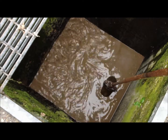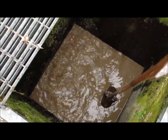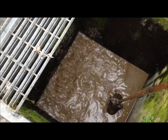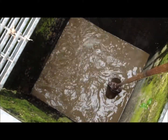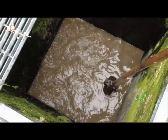As you can see, that's coming through quite watery now. It's quite difficult to see when our tanks go to water because we have a quite shallow wet well on the pumping station which pumps up to the sludge holding tank, so you have to guess the consistency. As you can see, it's coming through a lot more watery now — you can just tell by the consistency, it's gone from thick to thin.